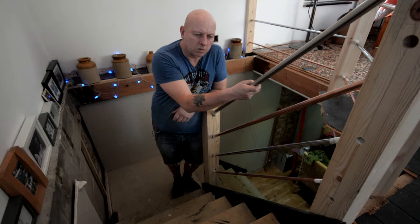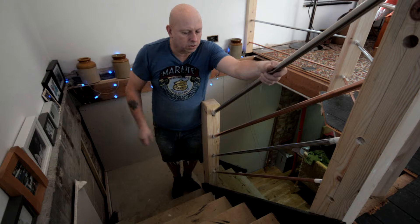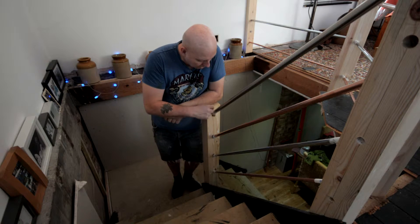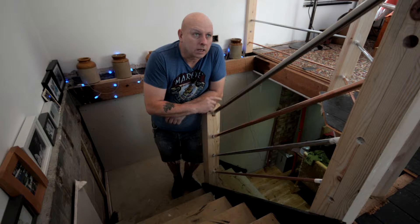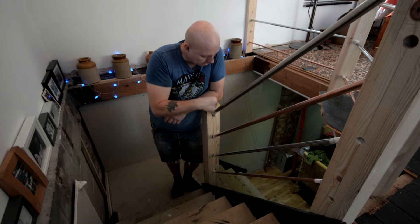This rail — I didn't want to rely on glue when you're pulling up, because as you walk upstairs you tend to put weight on the rail itself. So to get it in so it's hitting the wood, I drilled the hole twice as long up that end on that newel than it is this end.